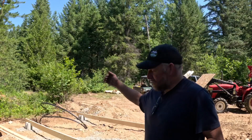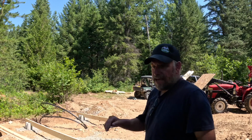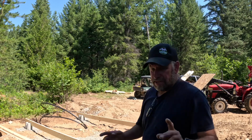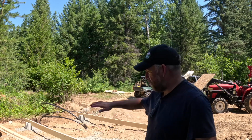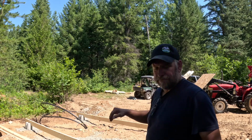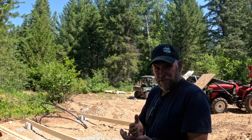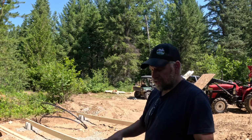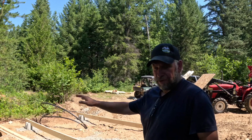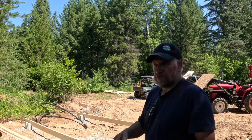Really what should happen now is you should lay the floor joist, cut pieces, put plywood inside, and then put insulation. Well, I'm going to skip a step, sort of. I'm going to lay 3 full sheets on this, which equals 12 feet. So it's going to be 8 feet by 12 feet. Then I'm going to put my floor joist on top of that. Then I already have a place for the insulation to sit, and it's a solid bottom. Just going to go across there. I will periodically put some screws in just to suck it up.